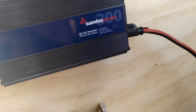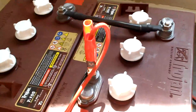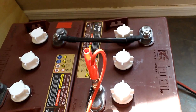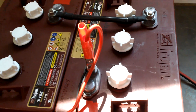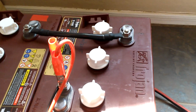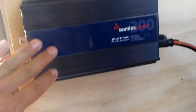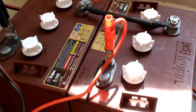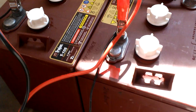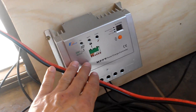I'm only running my office, which takes about 120-125 watts, so 300 watts gives me plenty of headroom. This will run just off the sun right now — battery is completely full. I can run my office all day for free, and at night with just these two batteries probably six to eight, maybe ten hours. You actually need four things: inverter, charge controller, batteries, and solar panels to charge the batteries. This charge controller does a great job because the MPPT is very efficient.